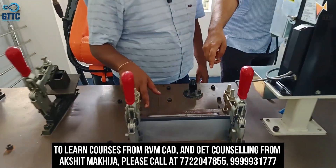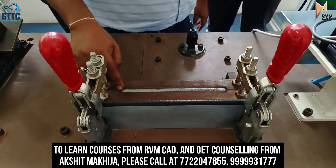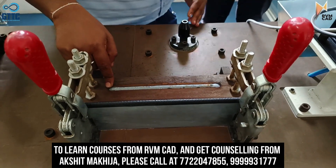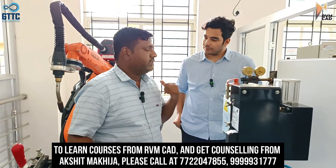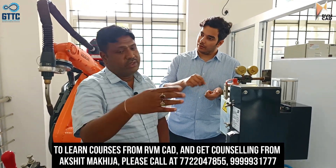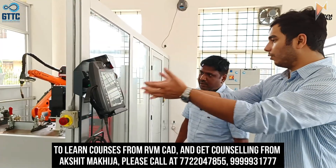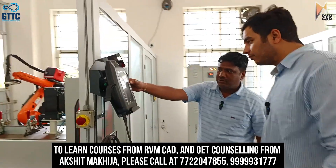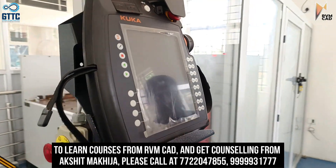This is a butt welding. First we have to take the robot from here to here — that we call jogging. Initially we will teach them to operate the basic robot: what all the axes will load, total six axes are there, and which button has to be pressed to move which axis. So you have a teach pendant — yeah, on that teach pendant, as you can see the smart pad over there, you have to basically hold it and do the programming. These are all the operation keys — which direction it has to be moved: axis one, two, three, four, five. We will see a demo that I will show later.